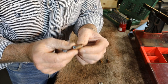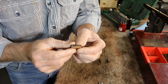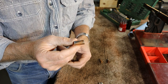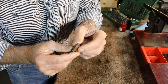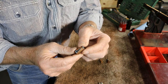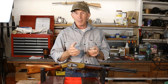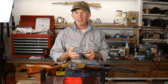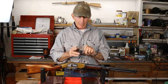It appears we've got a really loose chamber. What's probably happened is it had a lot of rust in that chamber at some time, got cleaned up, and whoever did it never intended to fire it again. We need to confirm that before we go any further, so we're going to do a chamber cast and show you our process on how we do that. The first thing we're going to need is an alloy or a medium to make our casting.